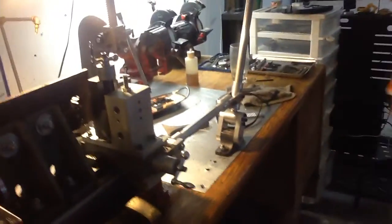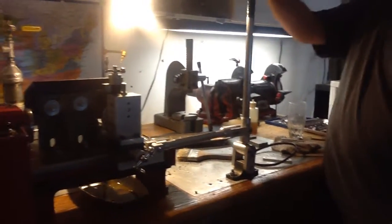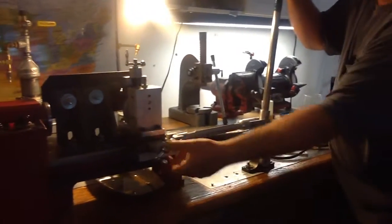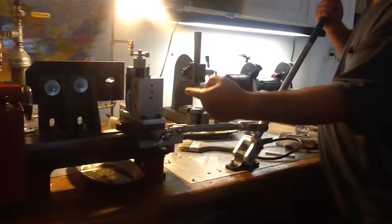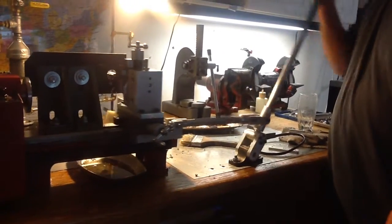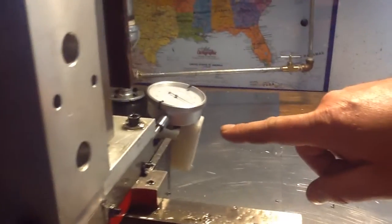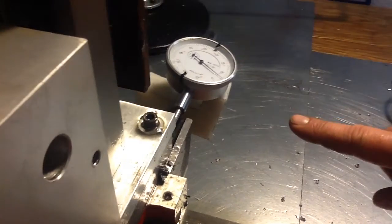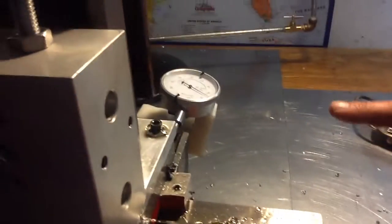Anthony, you want to take the camera here and keep it pointed at me and the lever, and I'm going to work it and show how it works. Keep it right there. So when we move the lever, it moves the carriage on the lathe. You can just go one pass at a time, do a couple thousandths, turn the thing, bring it back, turn it, moving the piece this way. Go again, bring it back, turn it, moving the piece that way — just eventually shaping your profile on your piece. I've got my dial indicator mounted on the back there so I can measure my depth of cut. I don't really like to count revolutions on the hand wheels — it's kind of a pain in the neck. So I've set that thing up so I can keep track of the depth of cut.